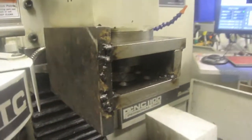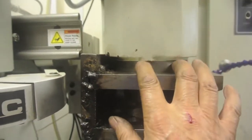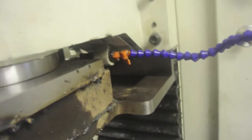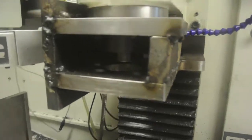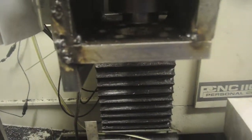I've finished the initial fabrication of the gang tooling adaptor or plate. It's secured by four M8 studs or bolts running right through here into the main casting of the head. You can see the heads of the allen cap screws — I had a job getting them in, so I drilled these access holes through here. I may modify this, machine it flush, and arrange some left-hand tooling on one side, right-hand tooling on the other — though you can correct me if I'm wrong on that.